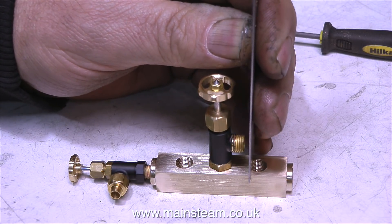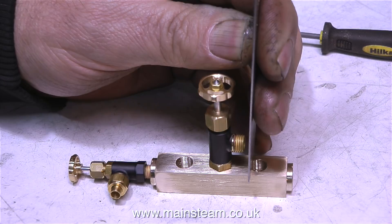Here's the finished manifold. It's important that the holes are in the correct position relative to each other — if they're too close, you will not be able to screw the taps into position. The best thing to do before you start is to lay everything out on the bench and do what could be called a dry run. I can't really give dimensions on this one, because it depends on which kind of steam taps you're going to be using. So that's the steam manifold made. Thanks for watching, and I hope you found it useful.